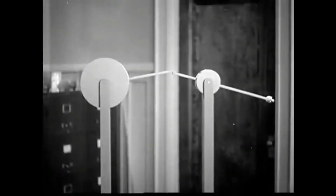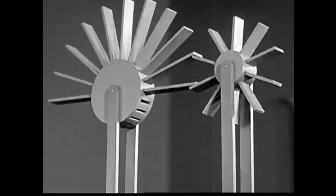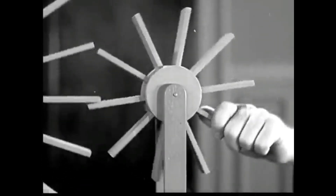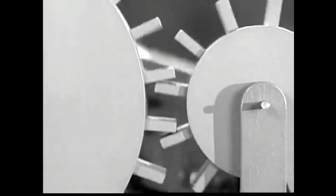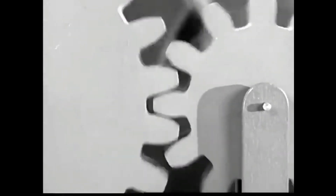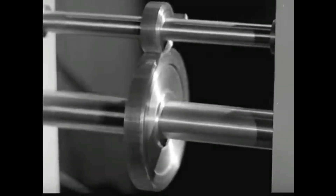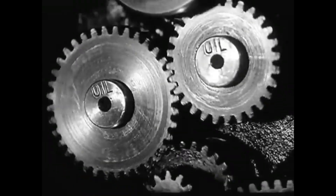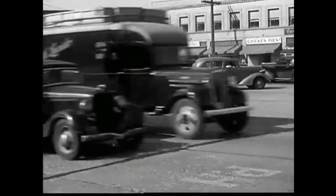For continuous motion we need more arms. Now we have levers that turn — the larger paddle wheel makes fewer turns but delivers more force. A paddle wheel is nothing but a never-ending series of levers. We can make the wheels stronger and lessen friction by rounding off the edges and shaping them into teeth that slide in and out smoothly. Now the power flows smoothly and continuously through the spinning leverage of gear wheels — gears made in many kinds and sizes: little gears, big gears, worm gears, bevel gears, and even lopsided gears. Over a hundred million gears are spinning over the roads in the transmissions of our automobiles.